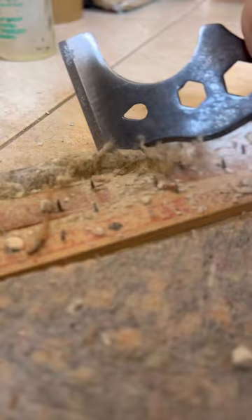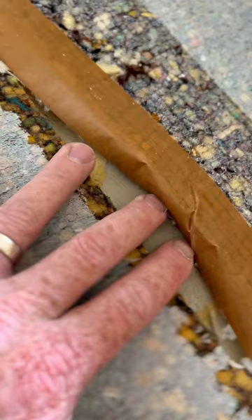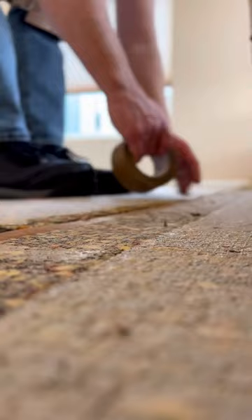Could you also check out the seam? It's gappy and nappy. We think the carpet cleaners used too much water and shrunk the pad. Looks like the installers did a poor job. See how wavy and lazy that tape was put down? I'll glue and tape back in place, making sure it doesn't gap again, no matter how many times you clean it.